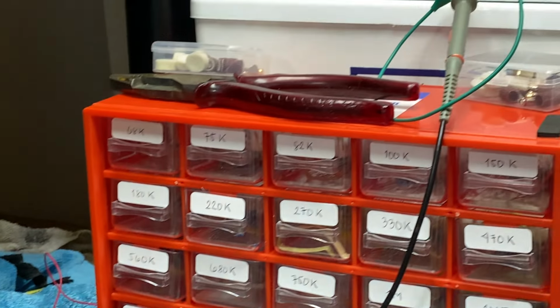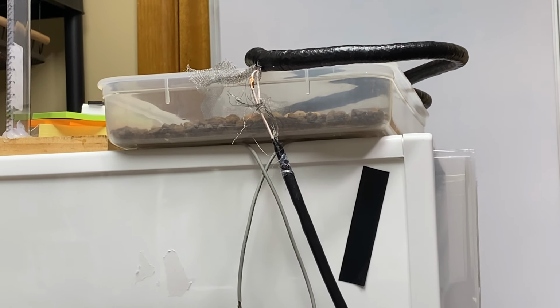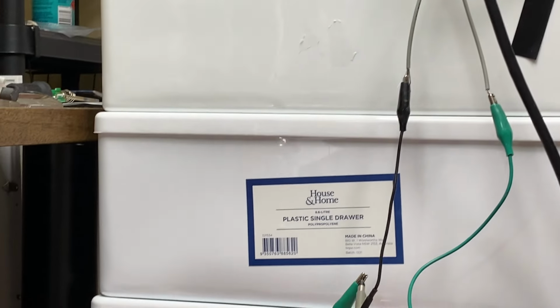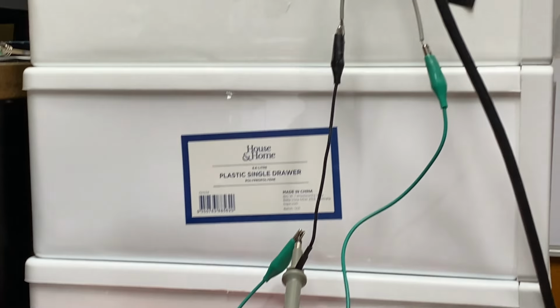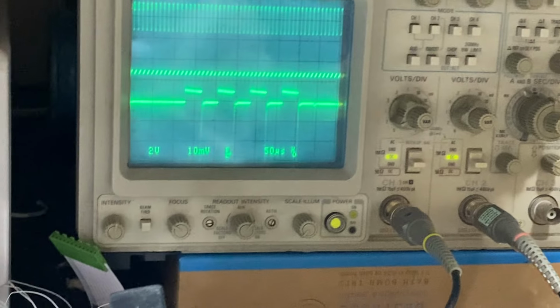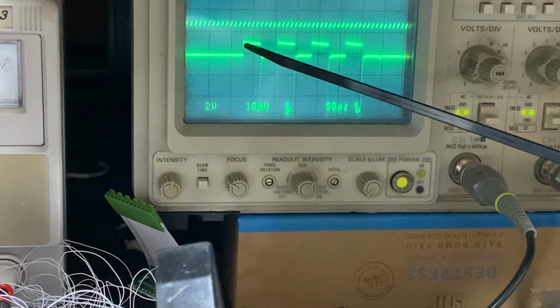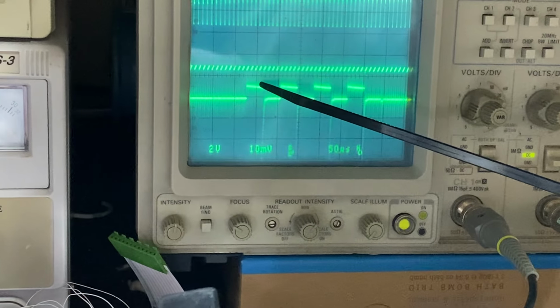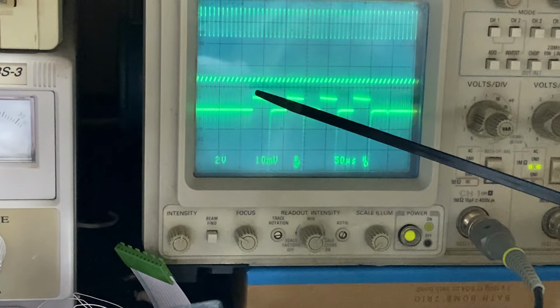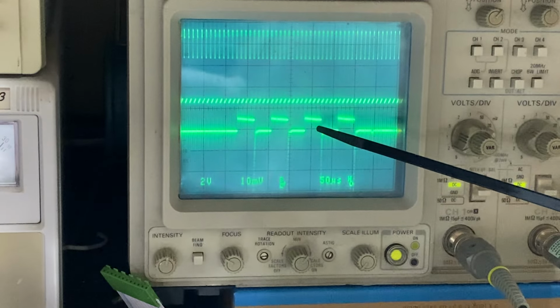Now, the way I've got it set up there, whoops, don't do that too fast. People tell me off. But it's set up there on a cancel coil, that bent looking thing. That's where I've got the oscilloscope connected up, just on a piece of wire as a pickup. I'll go slow. It depends where the wire is, so you get these transmit pulse flyback.